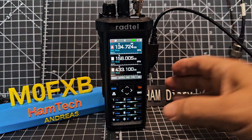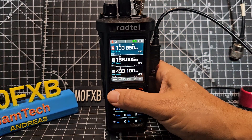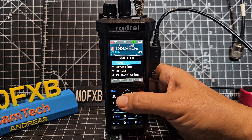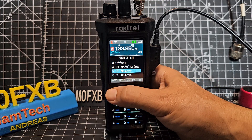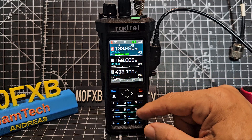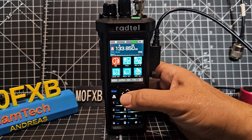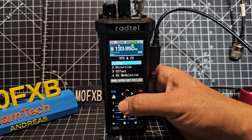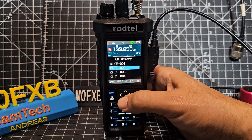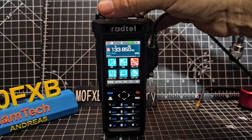But this video is about air band - it's very simple. Type in the frequency, and once you've got it, if you want to save it to memory, press menu, go across to VFO channel mode, go down to Channel Memory, select it, choose the channel number and the memory slot, select it, and it puts it in there. Bye for now, thanks for watching, all the best. What a fantastic radio.